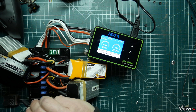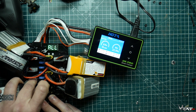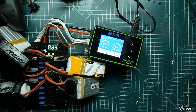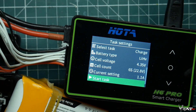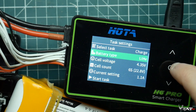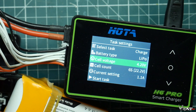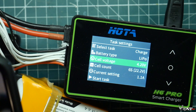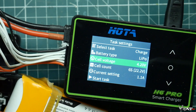Now let me show you why you can charge so fast. The capacity of your charger matters — mine does up to 750 watts, so that's where you're limited. I have five batteries here, so 5 times 1.3 amps gives us our 1C charge rate. Let me calculate that: 1.3 times 5 is 6.5 amps. That's what I'm going to set my charger to, because I'm charging five batteries.